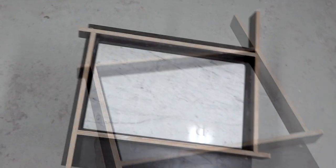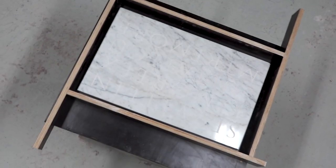So this is the situation now: we have the inscription nicely embedded into a framework of plywood that will contain the silicone when I pour it over the work. And you can see that I've left a couple of centimeters around the marble so that once poured the silicone will have enough thickness to maintain a relative rigidity.